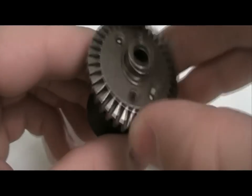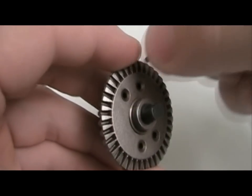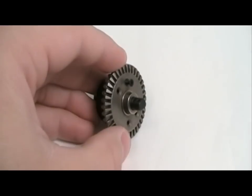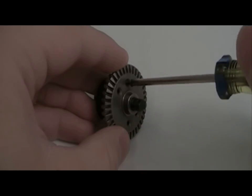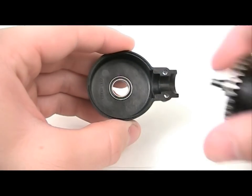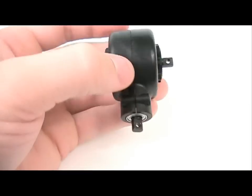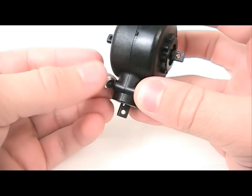And lastly, the ring gear. After lining up the holes, thread all four screws into the gear. After placing the bearings, place the ring gear assembly and the pinion gear with the bearings. Then the other side of the case. Lastly, threading two screws holding the differential case together.